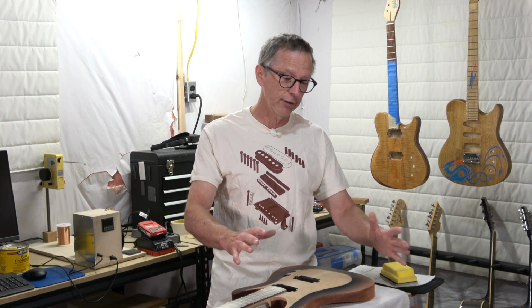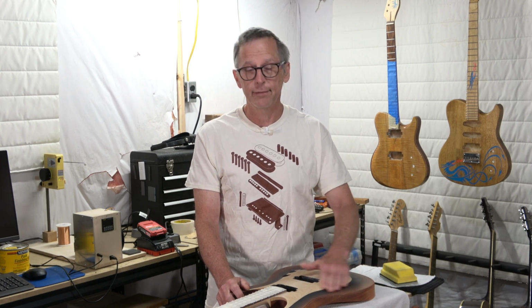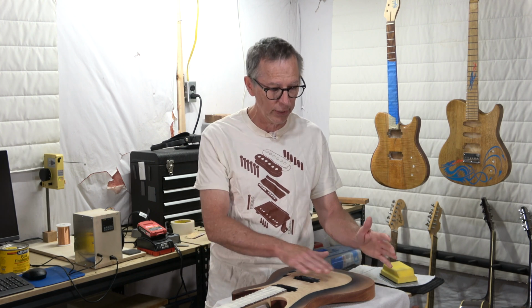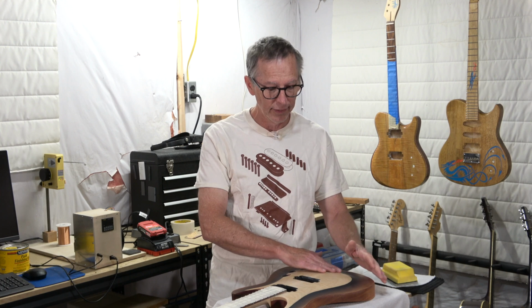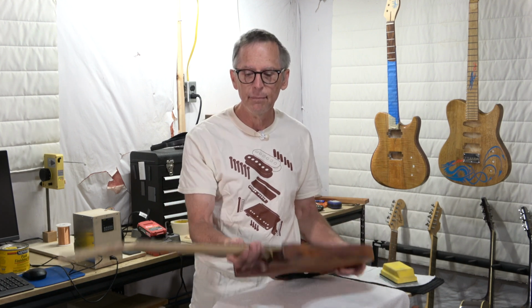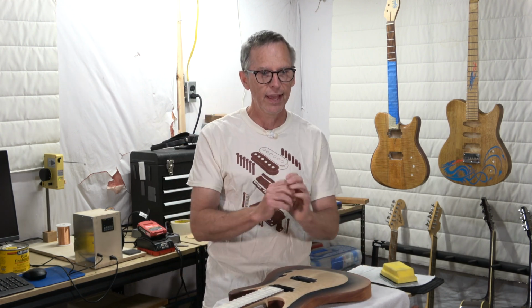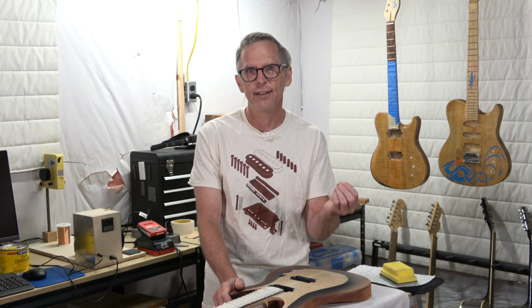So if you've got this nice looking hand rubbed matte sheen on your gloss clear coat, as soon as you put the guitar into a case and tote it around town for a few days, you're going to notice some shiny spots starting to appear where the inside of the case is rubbing against the surface. Also, as you're playing, wherever your forearm might rub against the surface will bring out a shine. Same thing with the back of the neck. If you're going for that really super smooth matte sheen that has that incredible silky feel, if you spray a gloss clear coat and then try to rub it out with steel wool, eventually you're just going to polish it right back up to a sticky feeling high gloss shine.